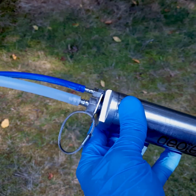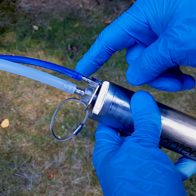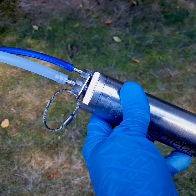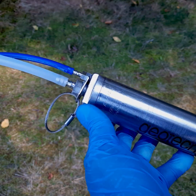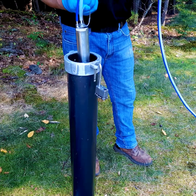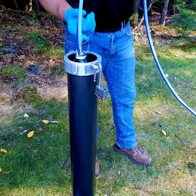There are two tube fittings at the top of the Geotech bladder pump. One is for the air — that's the blue line — and the other is for the water discharge. Air is provided via the blue line that compresses the bladder, and then once squeezed the water will go through the natural line to discharge into your discharge bucket. Once the two tubes are connected to the top of the pump, the pump can be lowered down into the well. There's also a stainless steel cable provided for added support if needed.